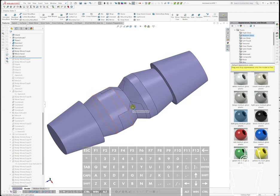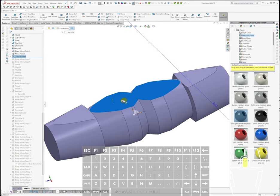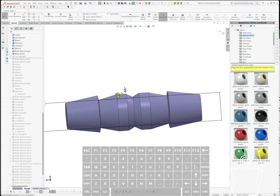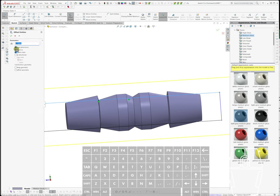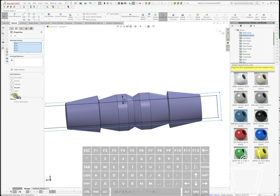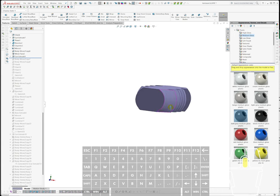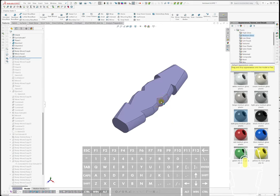And I hope that didn't break too much. What is going on there? Oh, that's just because I have both of these here. What I was saying is where it's touching the bed, it's going to be flat anyway. And even more so because I'm also going to offset this, reversed, and call it 20 thousandths. I meant to make this construction. So now it's going to be even flatter. Like the overhangs here, before I did that, it was a little messy. And I don't need these to be full diameter, not at all. So that should be good for that.